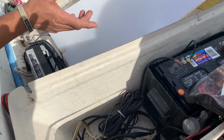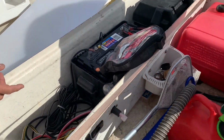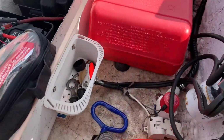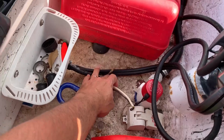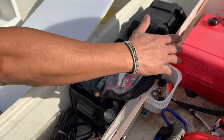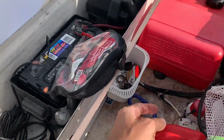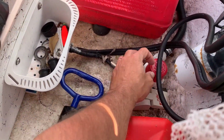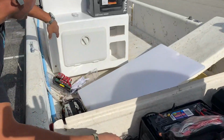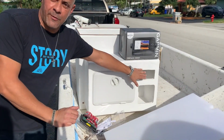If you're doing the bilge, you probably want also maybe an 8 foot piece of number 14 gauge, which is a much smaller wire like this. So an 8 foot piece of 14 gauge for the bilge. Right, because you want to take the functionality of it, the switching mechanism, bring it to there, so that way you can turn it on and off from over here.